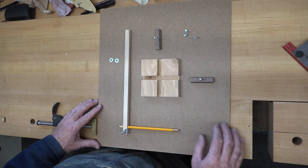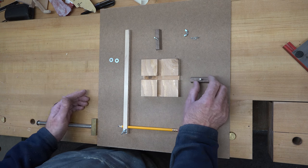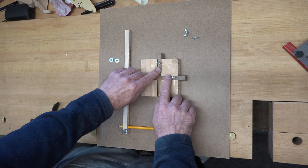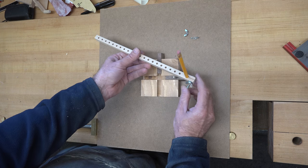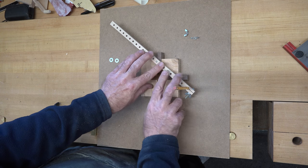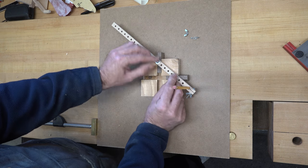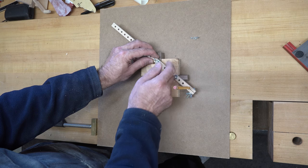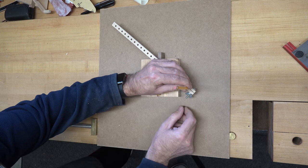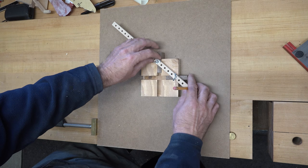With all those holes drilled, that's all the parts for the jig. I've got a piece of quarter-inch hardboard with the base plate double-side-taped to it. Slide your sliders with their bolts into opposite grooves, then take the drawing arm and choose which holes to place it into. Adjust the pencil height and tighten everything up — now you're ready to draw your ellipse.